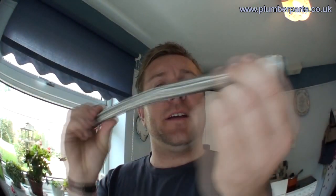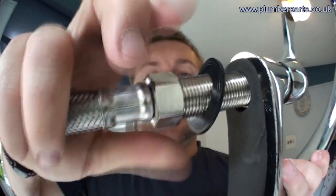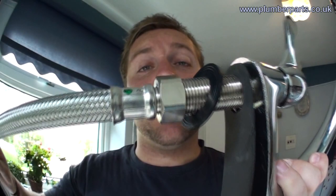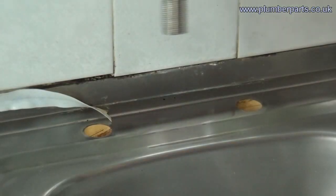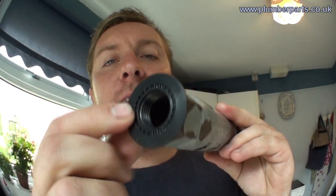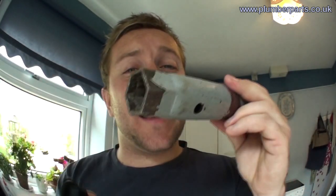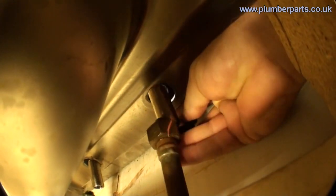Before we install this tap, I'm going to show you how the flexible tap fittings work. This is a push-fit one — you've got the nuts that fit just in there and you can slot that up underneath and tighten that up. You can get great purchase on these as well, so you can tighten up the nuts really hard. We get our rubber nut, rubber washer, and plastic nut. Put that on like so, start tightening that up, then finish off tightening with our tube spanner.